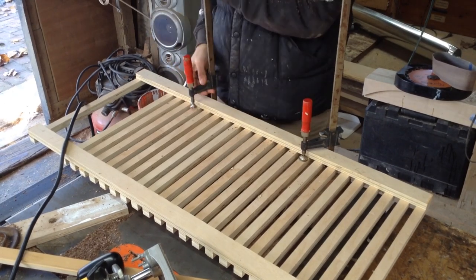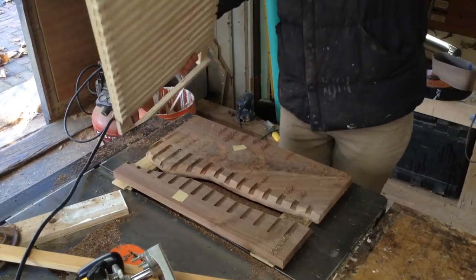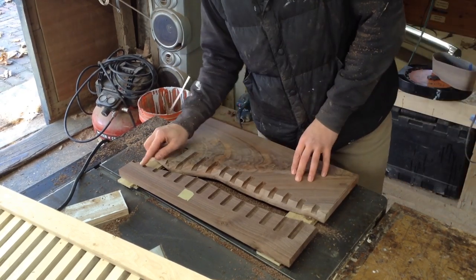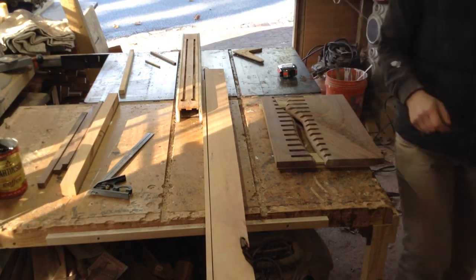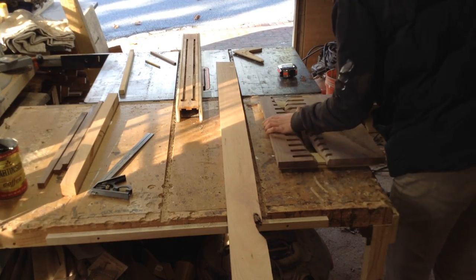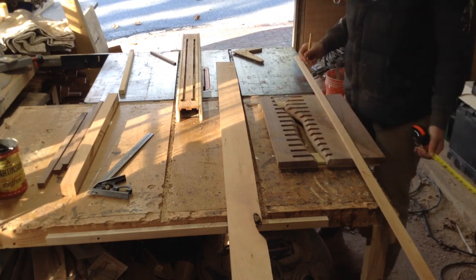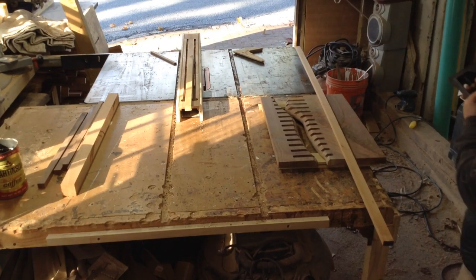For this one I'm using contrasting cherry for my slats — so it's walnut with cherry slats, and cherry with walnut slats. I have cherry in my shop and I'm ripping it down; same process. All of the slats are the exact same width, which is about five-eighths of an inch. Then I measure for the depth and cut those. Since there are small undulations in the stops and jig, I cut each one of these slats individually because they weren't all exactly the same.